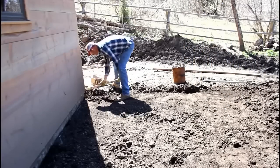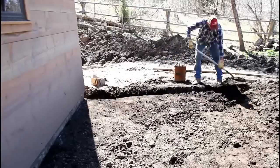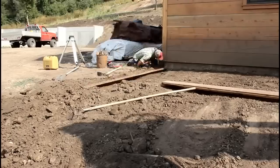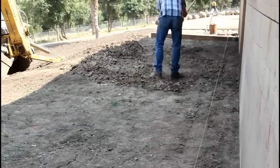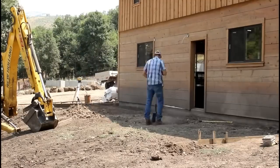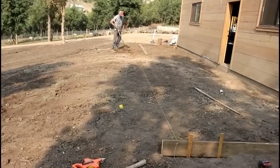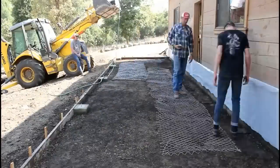I really wish I had a better explanation as to why this front porch had to be built twice, but I don't. If I'd had a little bit more knowledge and understanding about framing when I started this, I would have installed a ledger board instead of using the rim joist to hang the front porch off of, which would have given us the angle that would have been needed for the snow to slide off the roof safely.